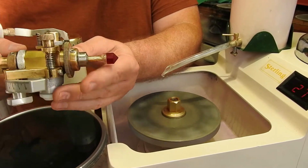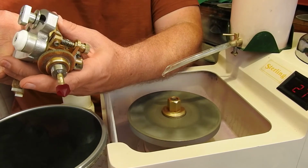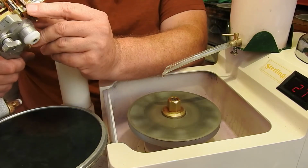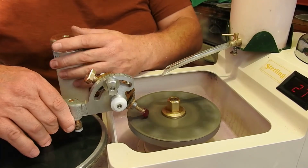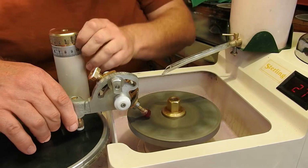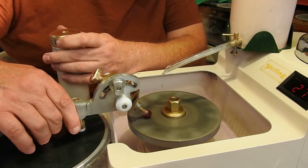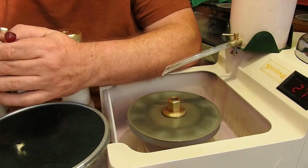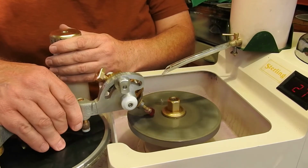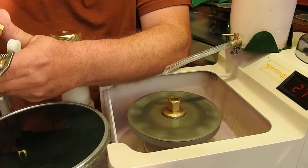So I'm now going to do the pavilion. So we start at the beginning, 42.32, which I've set, and 9 on the index wheel. Okay, and we're going to hope everything's aligned and make adjustments if not. Looks good. 40.98, lots of different angles.